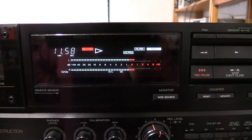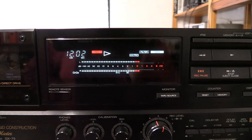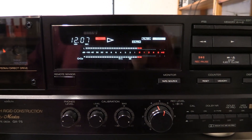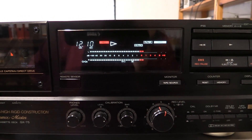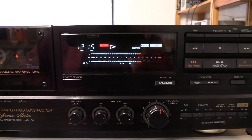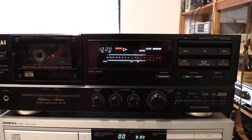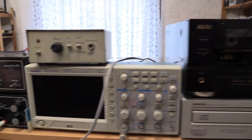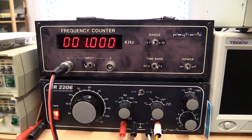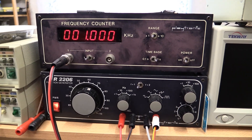You may see this fluctuating from time to time, but that is going to be due to dropouts of the tape. I actually had to set that a little bit out of balance to get this result. I got the tape nicely calibrated — bias and level and all that — so that should be all fine. See, there was a dropout. We are using this as a source frequency generator, and as you can see on the frequency counter, I have it set to one kilohertz precisely.